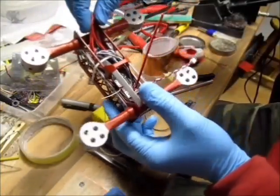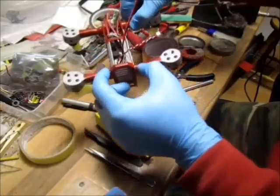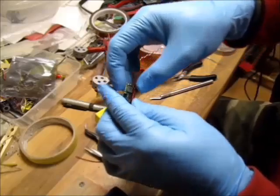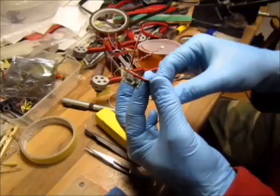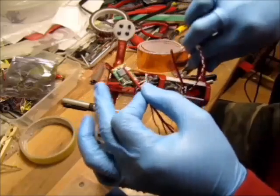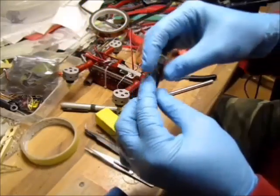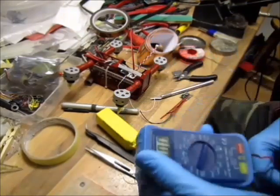Soldering still in process. Before I solder my power wires, I'll be running 4-cell, and I want to have some headlight LEDs and rear light LEDs that run on 12 volts. So there's a little voltage regulator, something like $2, but there's a problem with it. It is very noisy, and I will be having it right underneath the cloverleaf antenna. So I have to get it grounded. I'll be using the copper tape to ground it to eliminate the noise. So let's get it done.